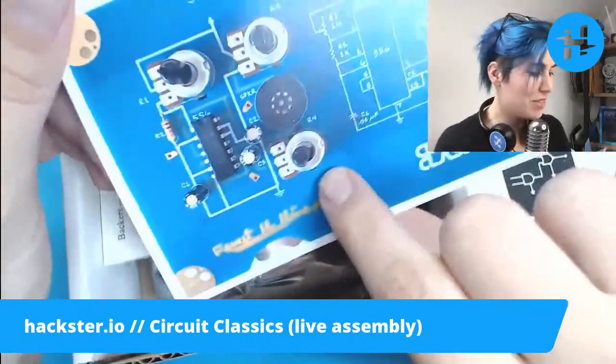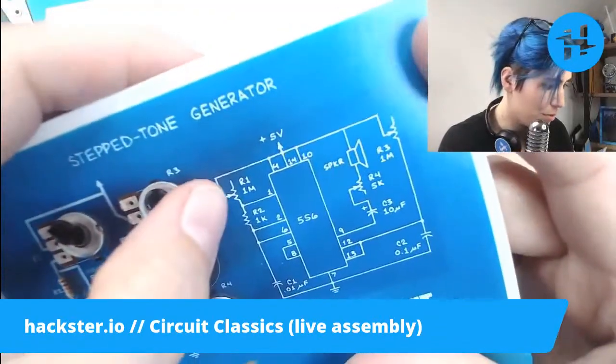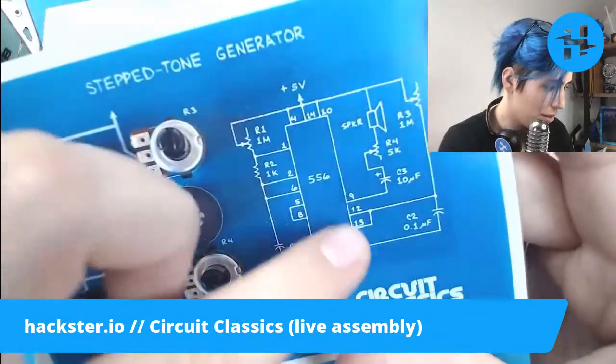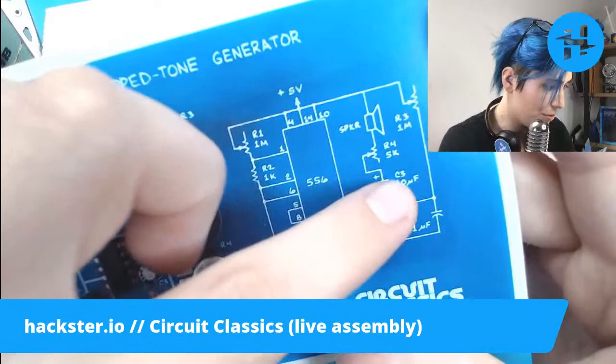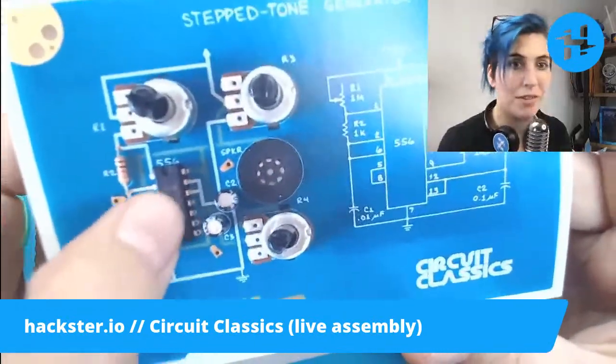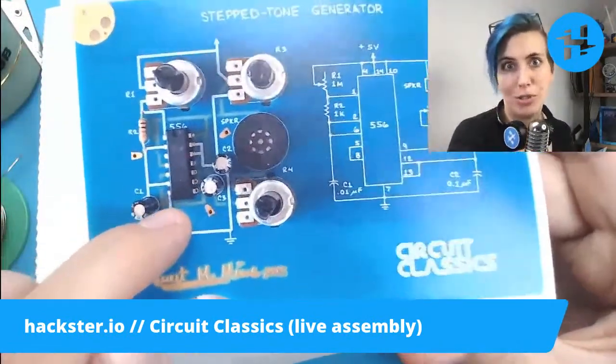We've got three potentiometers. I wonder what values they are. 1 megaohm. These are all variable resistors. 1 megaohm and... where's the third? Oh, this 5K. Cool. Then you've got your little speaker. You've got a chip, which is a 556. That's made of two 555 timers stuck together in one chip, basically.